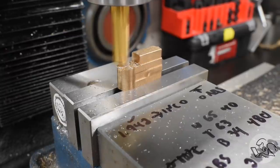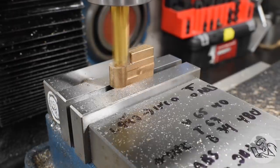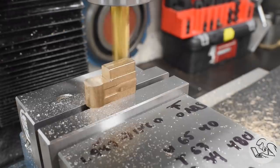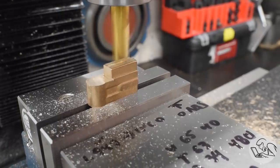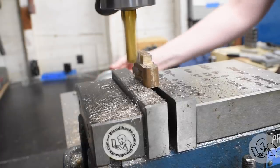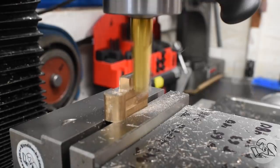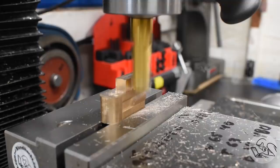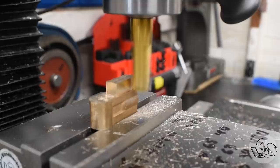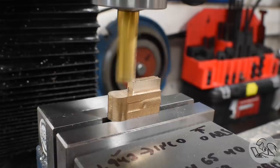One more pass and now that that depth is established I can mill the leg. I'll do this one differently because we have a nice perfect reference now against the fixed jaw from the other leg. I can just machine the back side of this leg all the way to zero plus the end mill radius and know it'll be identical to the other leg. Then it's a simple matter to machine the front of this leg to final thickness, ensuring both legs are at the same height and the same thickness. This crosshead is going to run very true in the rails.